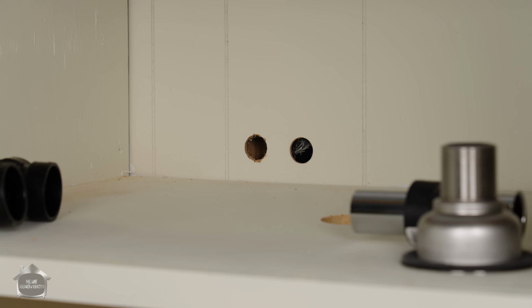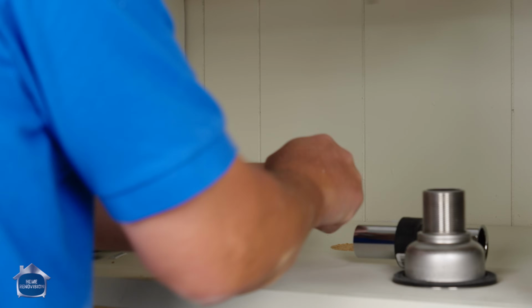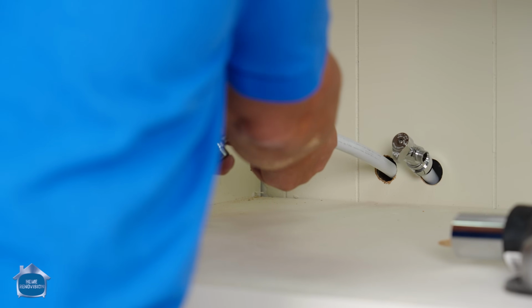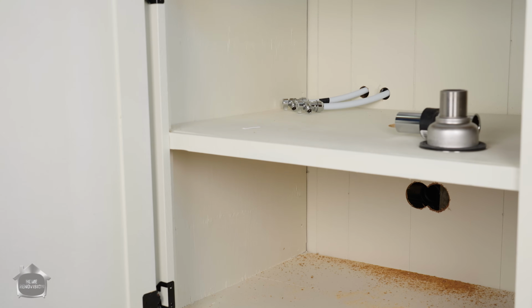Okay, so here come my water lines. Now where we're from, the hot line comes through on the left. And just to make life easy, I have one type of PEX, but I put electrical tape on the hot line so I can identify it. And there's my cold. Because I'm going with SharkBite, I'm just leaving this connection undone for now. And then later on, I'm gonna make the connection in the back. I'm just crimping with solid copper rings. So I've got everything kind of prepped up. I'm pretty much ready to go.